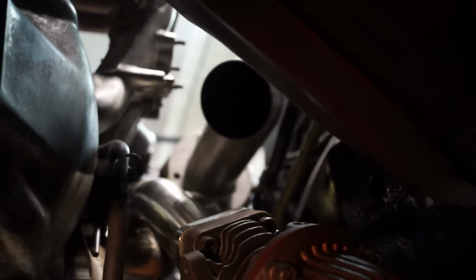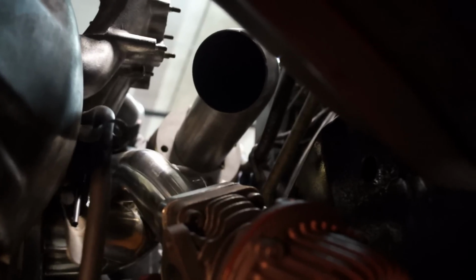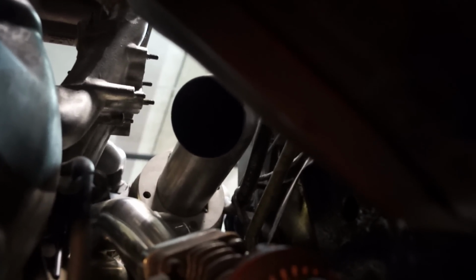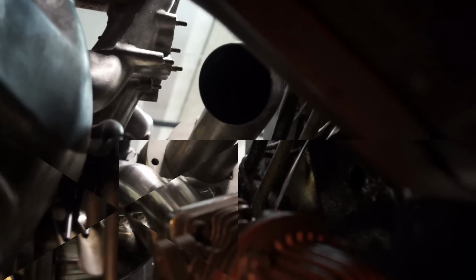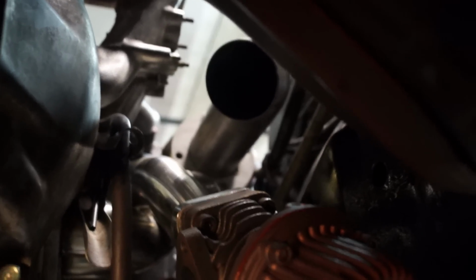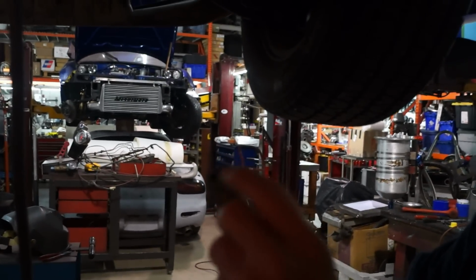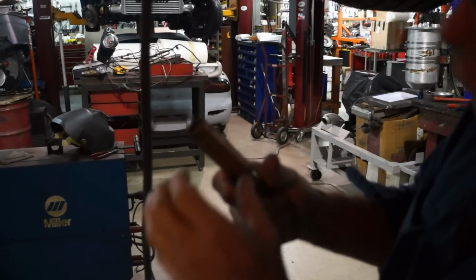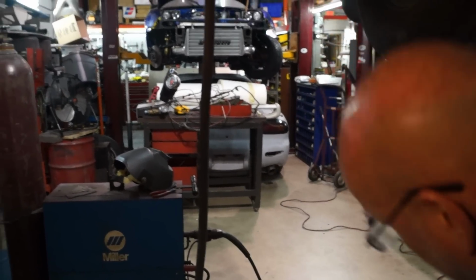Right. But you see, I focused more on the heavier metal than the light one, and it went enough to grab it. Two welds is minimum, but it wasn't really hot enough because it left a little ball here. I gotta give it more heat, because that stainless flange is pretty heavy. If it's perfect, it'll just finish off without balling up.